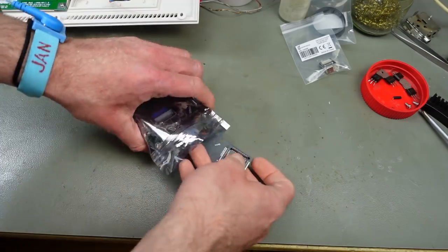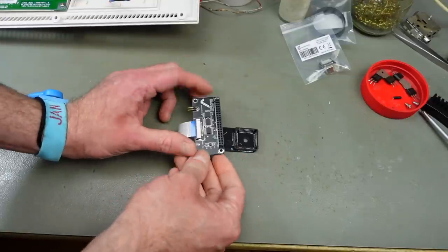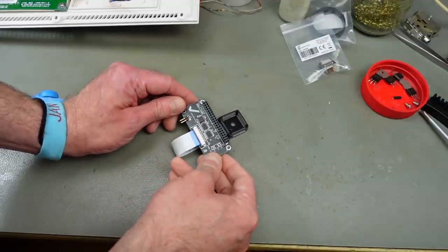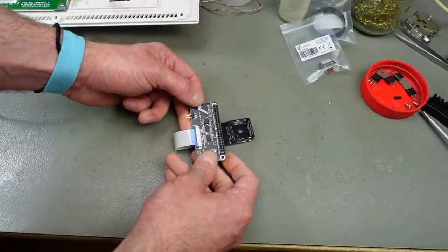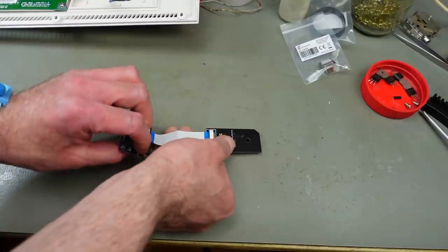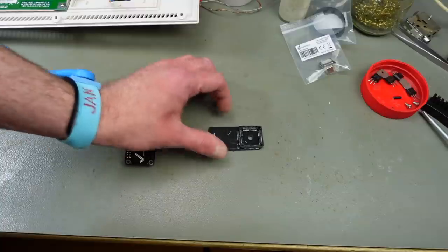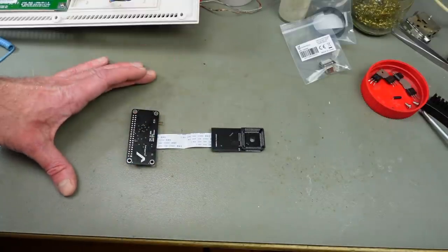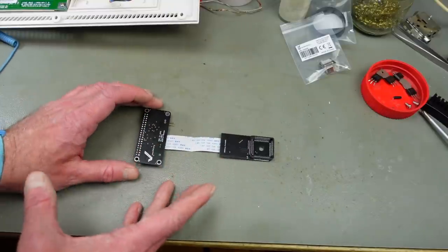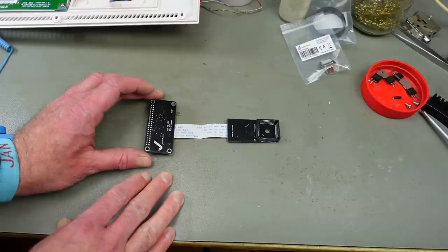Now the rest of the stuff we need, apart from the Raspberry Pi, should be in this bag. You can have these circuit boards made — this is all openly available on GitHub. It's a version of the RGB to HDMI board, pretty similar to what we've seen with other versions I've shown on this channel, but it's designed to have a flat flex cable coming out and a PLCC socket that plugs on top of the Denise chip in the Amiga 600. These RGB to HDMI boards still only work for the ECS and OCS chipsets — you can't put them in your Amiga 1200 or 4000. The ECS screen modes somewhat work but not perfectly; the OCS screen modes are what we'll be viewing in full HD.